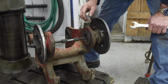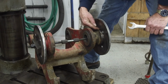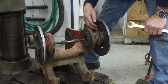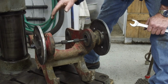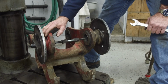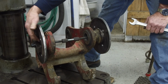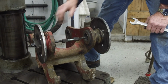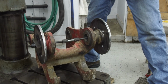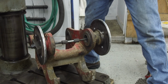And we're going to go ahead and put probably 2 tacks about 1/2 inch or 3/4 inch long on 2 easy access points on here, so that we can get in here with a grinder and grind down the weld enough to break it free, and then dress it off afterwards. We don't want a weld on the face, but this outside here is open air, and it's okay to put a little tack weld in there to fasten these to the project.